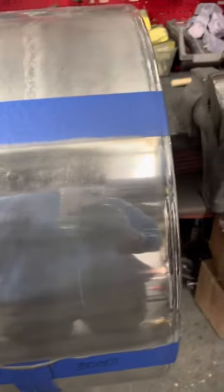If you look at this here - 400 grit, 600 grit, 800 grit - all good. 1,000 grit starts getting this black stuff. We can wipe it off, yeah, but it's not awesome underneath - it's not shiny like the rest of it. This is my training tank so bear with these excess hash marks. You'd work those out with a yellow and brown then go to a white and green if you wanted to make it really nice. But this is just for example. As soon as you get down here - 1,000, 1,200, 1,500, 2,000, 3,000 - it just gets worse and worse. I don't even think hand polish would take all this out, but I'm gonna give it a try.